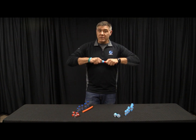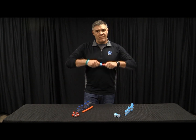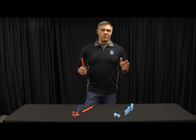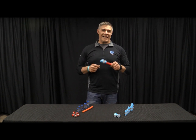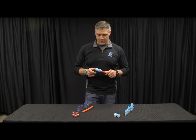So we push the coupler in and we try to pull it apart — can't do that. The pull force on these at seven millimeters, you're looking at 67 pounds of pressure. And at the 20 millimeter coupler, you're looking at 221 pounds of pull force in order to get that to separate. Again, if these are going into the ground, they're not coming off and that was important.